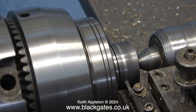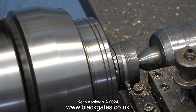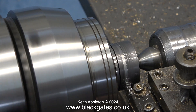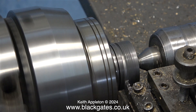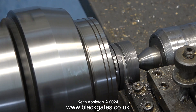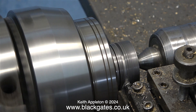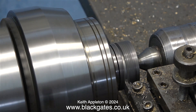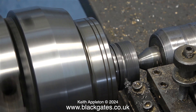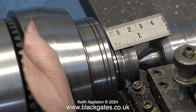The problem is I need to try and select the best speed to cut this diameter in a reasonable time. I'm using my Smart and Brown lathe and I fitted a single-speed single-phase motor many years ago, so I don't really have that many choices as far as speed is concerned. The lathe is in back gear and I'm using the highest speed of back gear — I only have a choice of two speeds. If you have a lathe with an infinitely variable drive then you can get the speed precisely right; this speed is near enough.